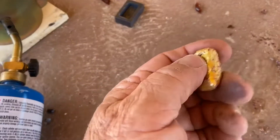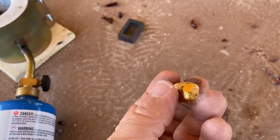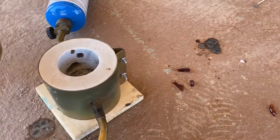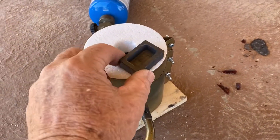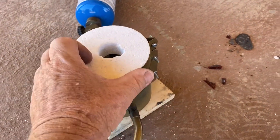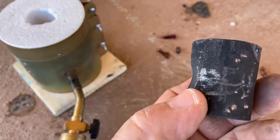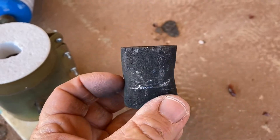You could probably put it in a mild solution of maybe nitric acid or something like that to clean it up a little better. One tip on your mold: before you pour, set your mold up on top there and get it warm before you pour. You don't want to be pouring hot liquid into a cold mold. I had it in there a little longer than I thought — looking at my crucible, I think it actually started to melt.